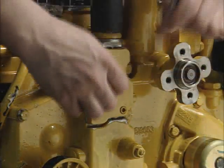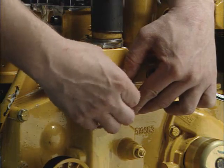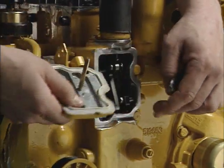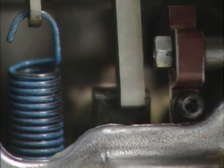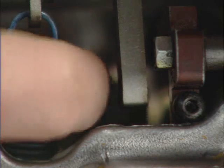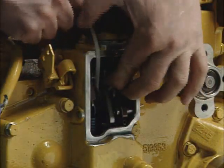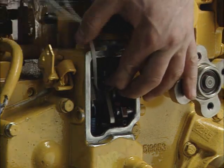The next step is to adjust the fuel control rack magnet. Begin by removing the governor access cover from the timing gear cover, then cleaning the mating surfaces. Pull back the electric solenoid shutoff lever and gently push on the fuel control rack. The rack must move freely without binding. Position the solenoid shutoff lever fully forward and secure with plastic tie bands.